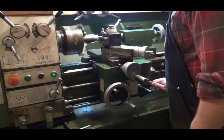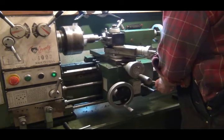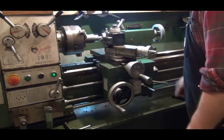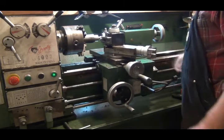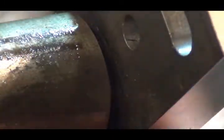I jumped and got ahead of the line this time. Before I get to the end — there we go. Now I'll come back in. I always run this back to 0, advance my cut up here about 5 thousandths. Okay, I got the threads cut. I've got this one top piece that I made — it screws on there. But the tap went in a little crooked. So that's going to be the main thing — getting this piece tapped straight.